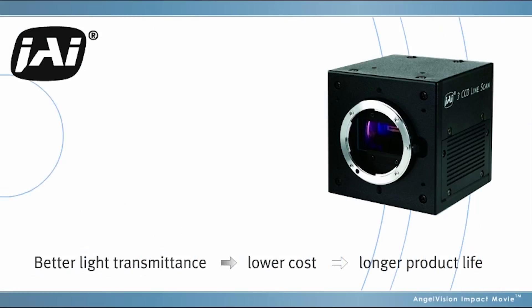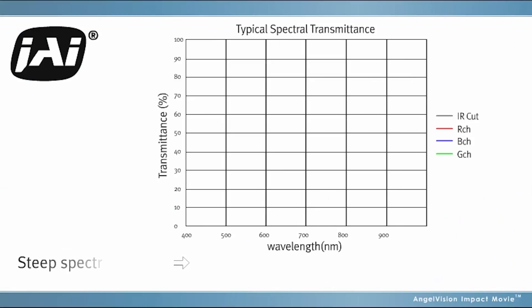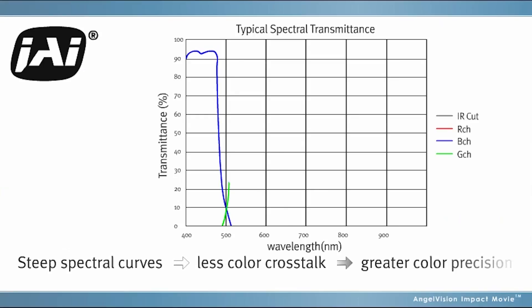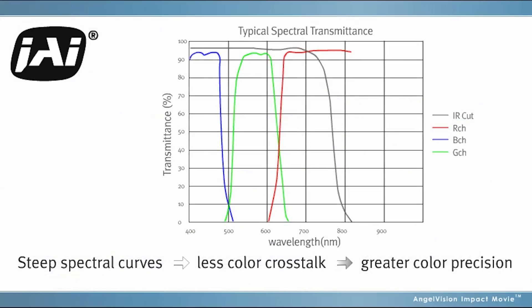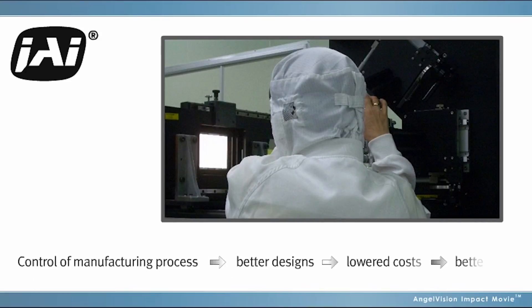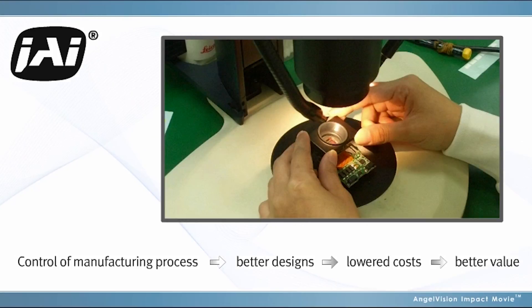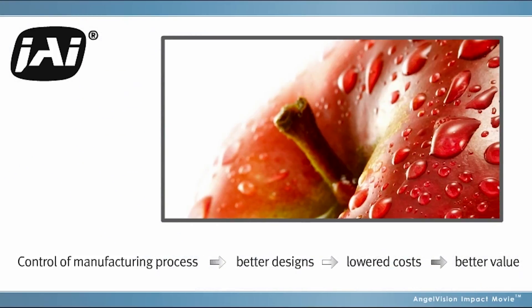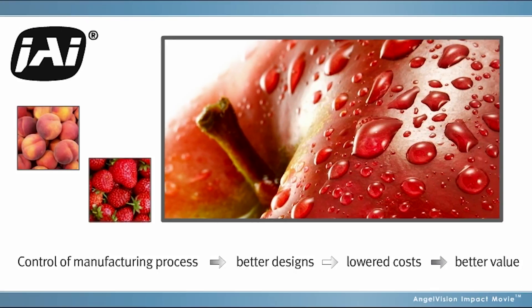There's no added expense for brighter lights and less color degradation over time. The steep spectral curves of the dichroic prism coatings cause less crosstalk between color channels than trilinear filters for increased color accuracy. Because we design and assemble our own prism technology, we offer more flexibility and robust feature sets than other prism-based camera manufacturers, such as smaller cameras that run cooler with higher signal-to-noise ratio for optimal image quality.